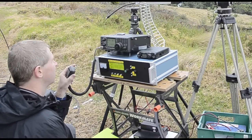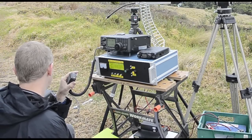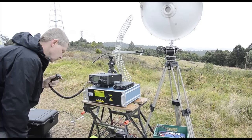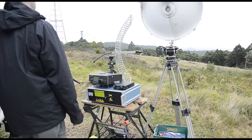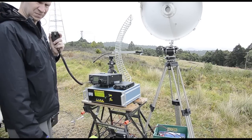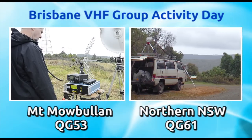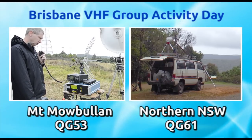You know, I'm running about 50 watts right at the feed point, so that's a 35 element Yagi at M squared that I've had under the house for a long time. So, yeah, great to work you on this frequency, and hopefully we'll do something on the other frequencies too. Just looking at the beam direction here, could be trying to force the signal through some local trees on 3.4 or higher band. But let's hope we can do something.